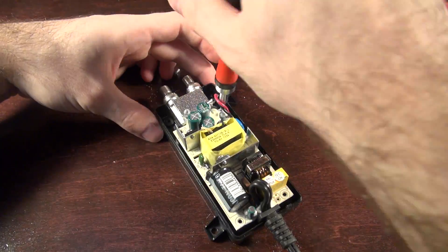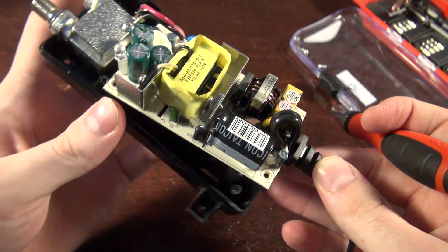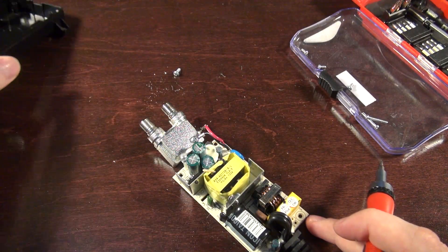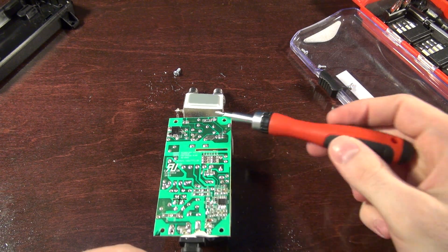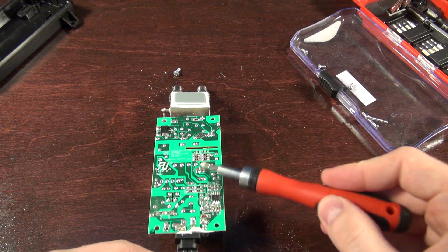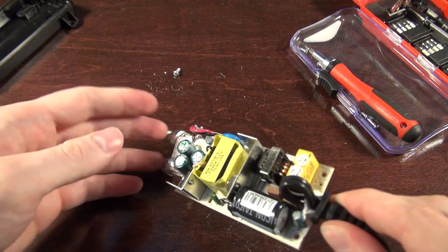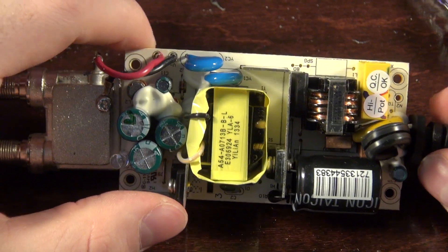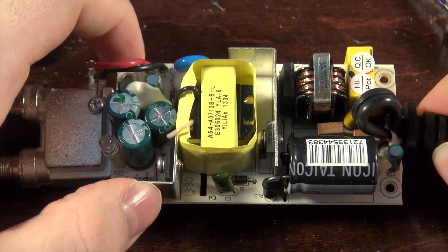Taking this out — I think that's all the screws and it comes right out. Back of the case is nothing fancy. This time I have a plastic insulated screwdriver, so I can run it all over and not discharge the capacitors on it. This is how you do things safely. So this is now properly discharged — not that this has run for the past three years or something. It looks just like a fairly standard switch mode power supply, like what you'd find in a laptop or a camera.